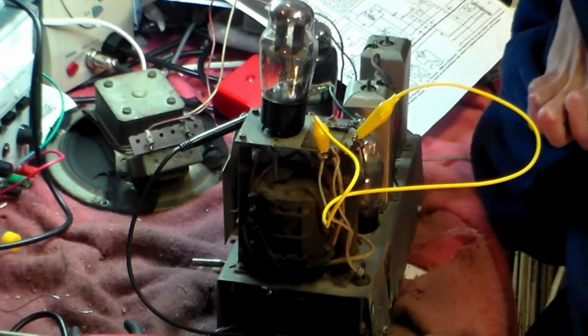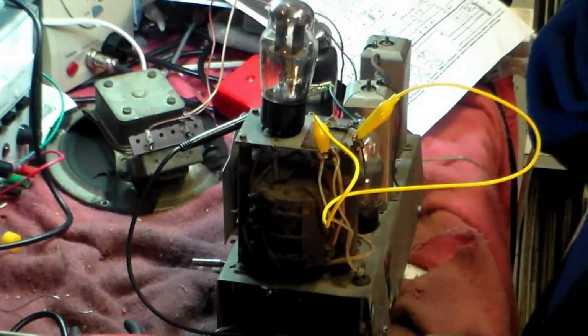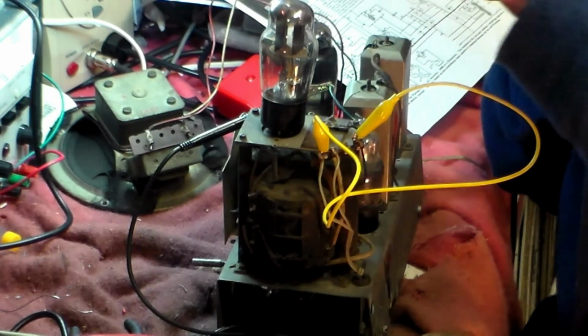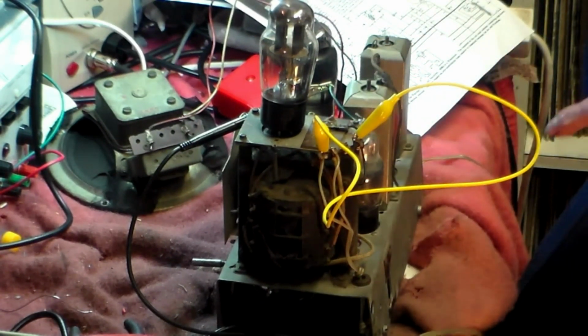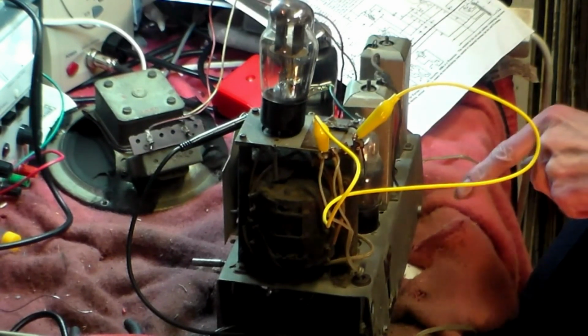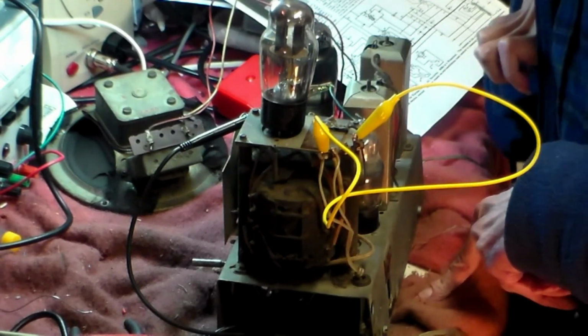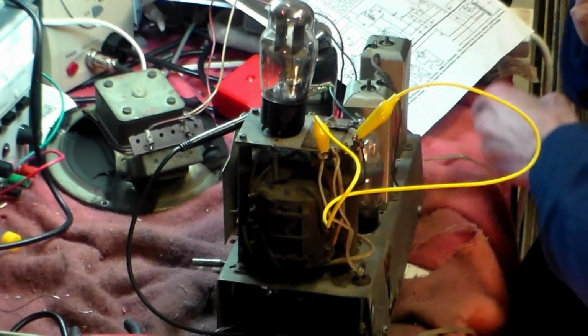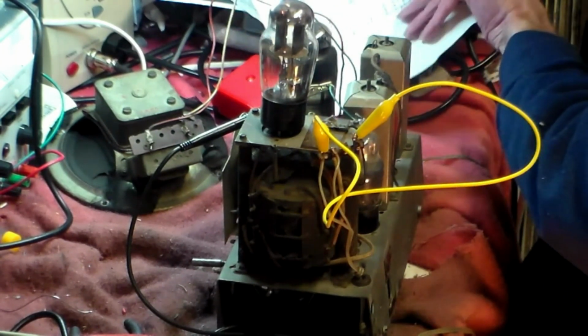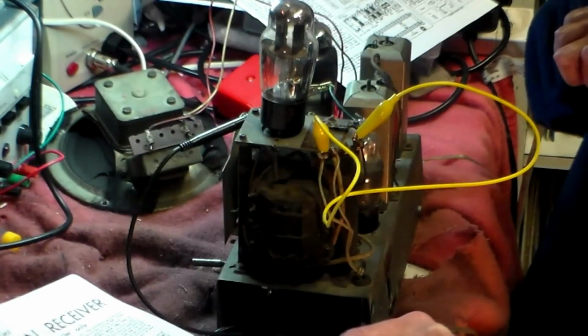I've changed those capacitors, but it didn't have a lot of luck actually. Maybe it's slightly louder, but nothing else. So what I'm doing now is checking where it stopped working. The IF can do okay. It must do, otherwise you won't get that. So it's looking at the valve 1 stage, of course, the mixer oscillator stage.